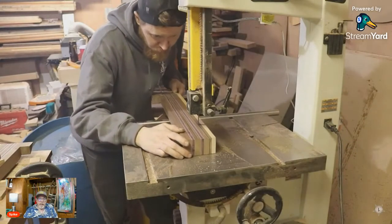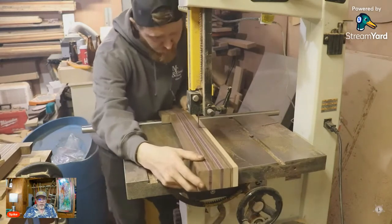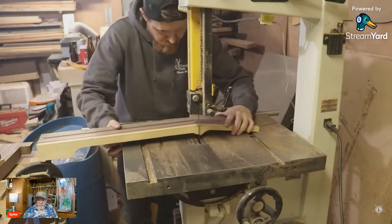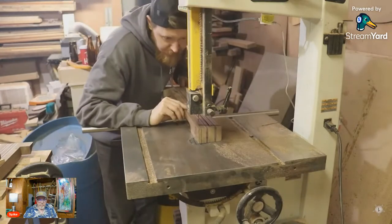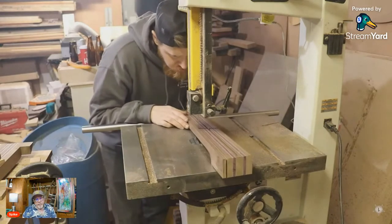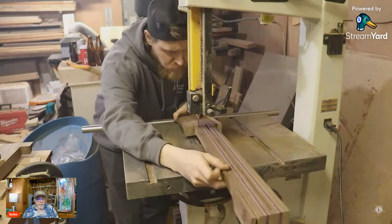Lisa, take that blade out. If it won't shave hair off your arm, you need to work on it. That's kind of the way it works. And like Lucifer said, practice on basswood. Nice and soft, easy grain. It'd be a lot easier for you. Don't start with a hardwood.